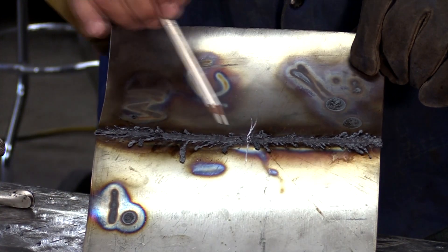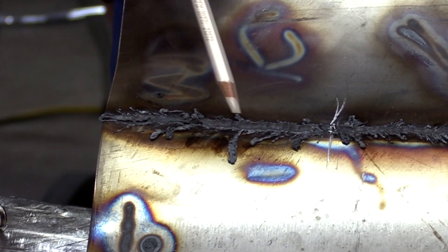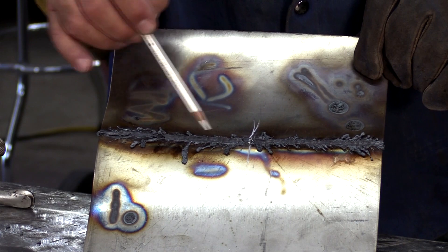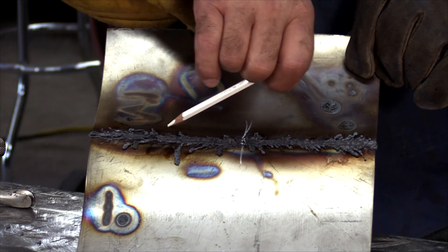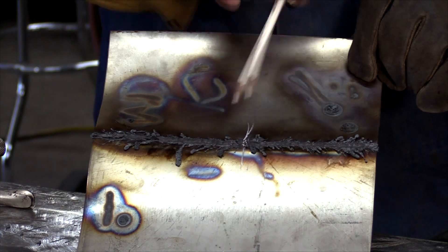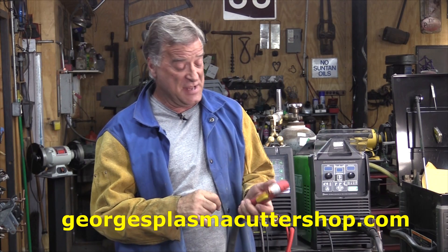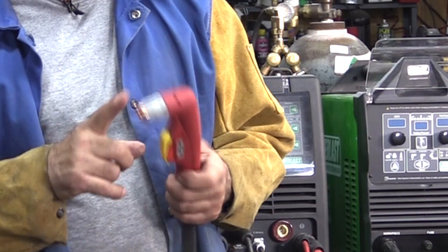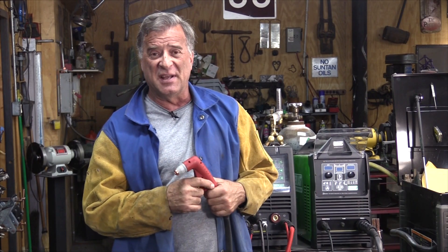20 amps on that side, 30 amps on that side. I can definitely see it's a little bit deeper right in here where I angled in just a little bit more rather than across the top — I was digging in a little that way as I moved. A great big thank you to George over at George's Plasma Cutter Shop over on the East Coast — he sent me the consumables for this IPT-60 torch. Thank you, George, I do appreciate it.